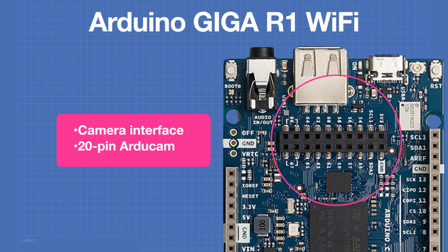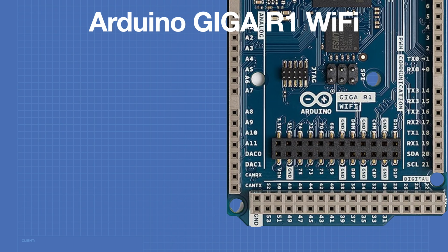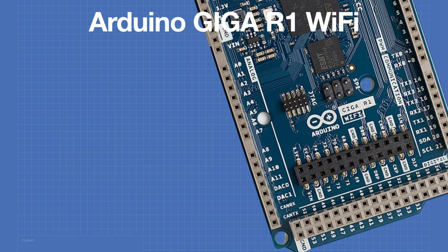Further down the board, we'll see a camera interface. This is a 20-pin interface compatible with Arducam cameras. If you're not using a camera, you can also use these extra I/O pins for your application. And on the other side of the board, there's an interface for a display that uses the Display Serial Interface Standard, or DSI. This is a 24-pin connector that again can also be used as additional I/O ports.